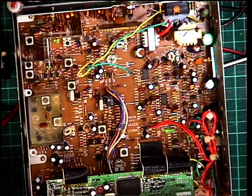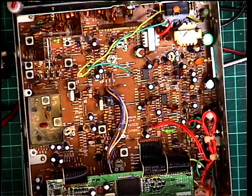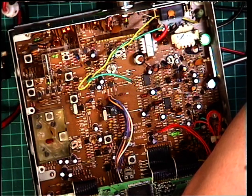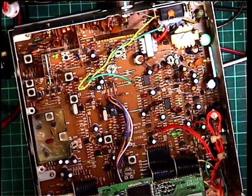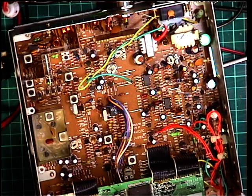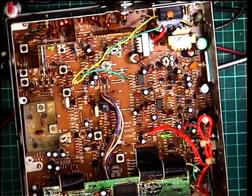So that's alright. I'll just see how our deviation is — we'll get our little oscillator. That's pretty low. Yeah, that's stupidly low. It's like 0.9 kilohertz. That needs rectifying.